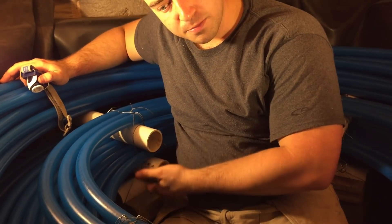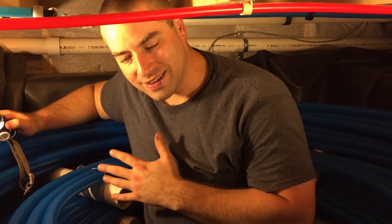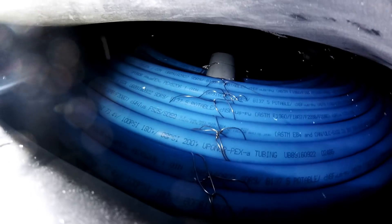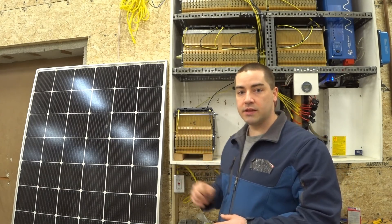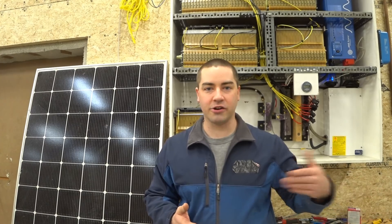The answer is that you use a heat exchanger. In my crawl space, that is a 300-foot coil of PEX tubing, which makes for a pretty decent heat exchanger. Full disclosure — if I were to do this again, I would switch it over to a copper coil. Inside the heat exchanger is the pressurized potable water — the drinking water that comes out the taps. Outside of that, in the regular vessel, the water does not get replaced or replenished. That water just sits there for the life of the tank and is a thermal battery. Just like the chemicals inside a lithium battery don't get replaced and just the electrons move in and out, in a thermal battery the heat energy moves in and out.